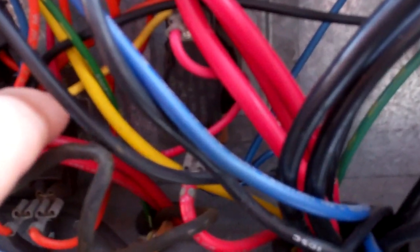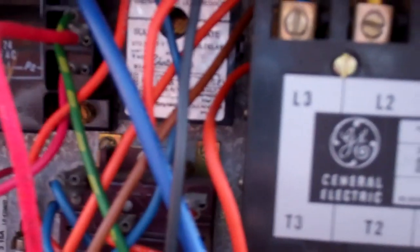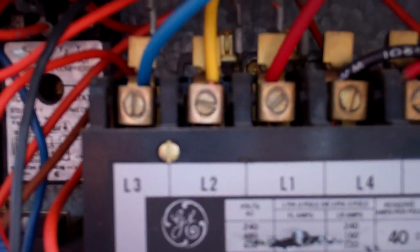And then it either goes off on the yellow wire if it's low speed, which goes under a coil there. Or it goes on this brown wire to the coil if it's high speed. And I think what the interlock should do is join the blue wire to the orange wire, and I don't think it's doing that — so we're only getting 24 volts on one side of the coil.